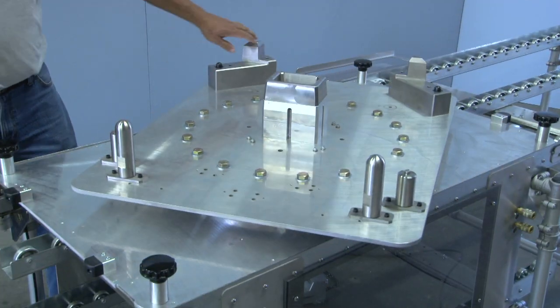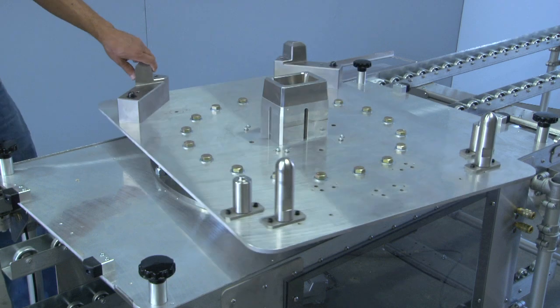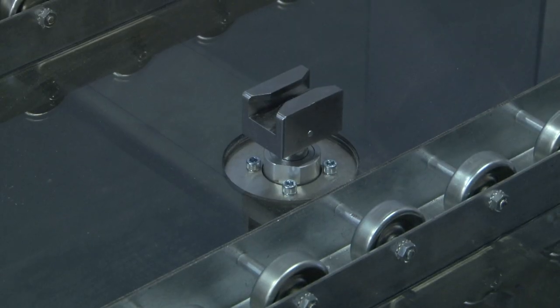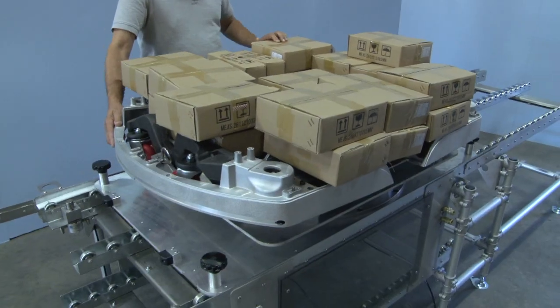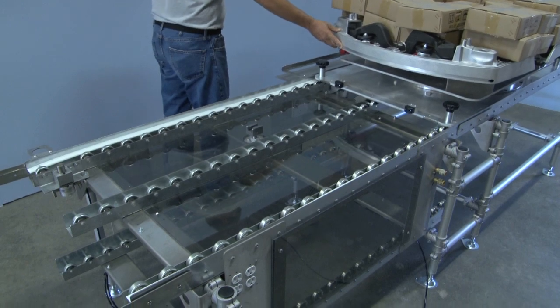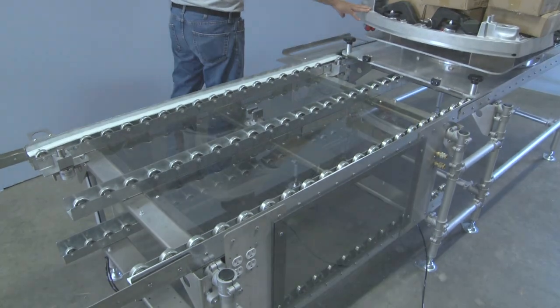For product rotation, we would use 30-inch diameter precision bearings with a spring-loaded locking pin for positioning in 90-degree quadrants. This resulted in a low rolling resistance and 8 to 10 pounds of breakout force to both move and rotate the fully loaded fixture.